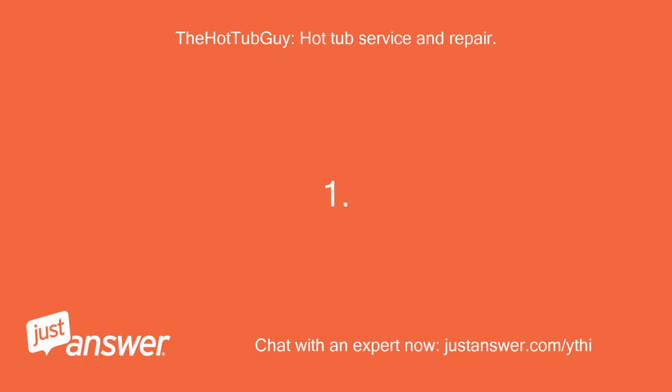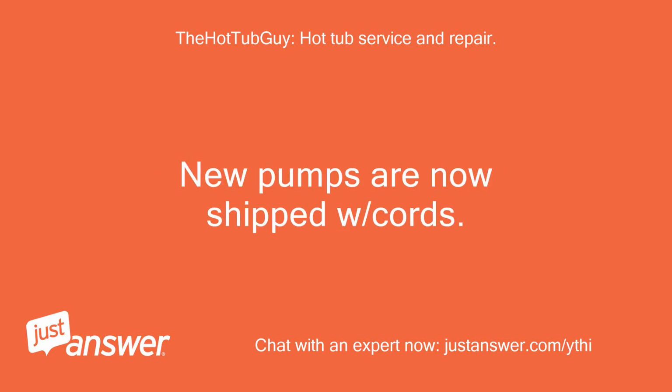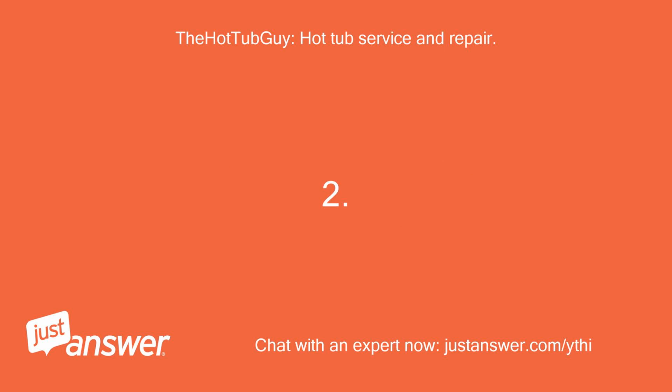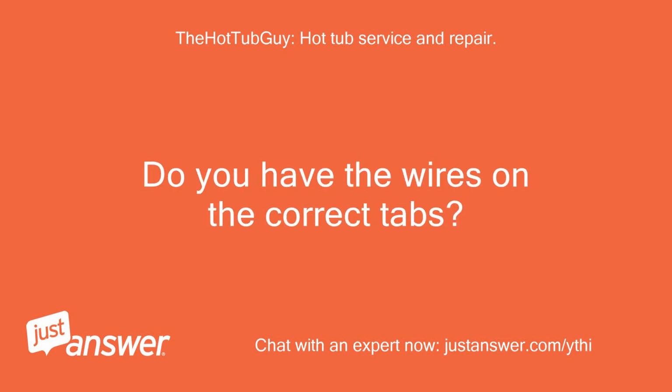1. What circ pump did you use and did you wire it? New pumps are now shipped with cords. Did you use a Hot Springs circ pump? 2. Is the circ pump getting 120V at the terminals? Do you have the wires on the correct tabs?